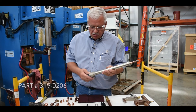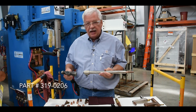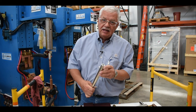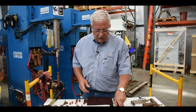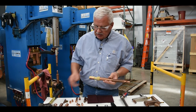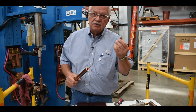There are several different types of holders. There's ejector-type holders, which we have here — that's what this button is. You take a hammer and tap the bottom side, and you'll see that the electrode comes out very easily. This is an ejector-style electrode holder. With this style, you loosen the knurled nut and do the same thing — hit the bottom and it ejects the electrode out.